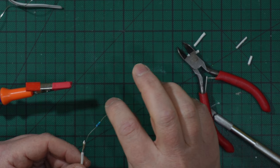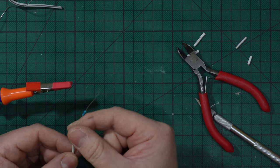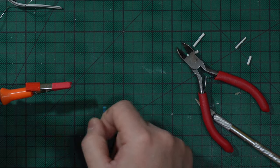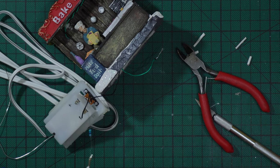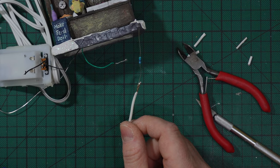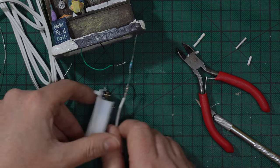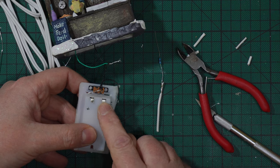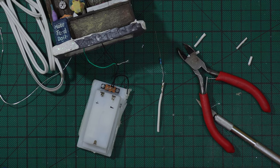This is the case of the single resistor you have seen. Here you add the positive or the negative, I don't remember correctly right now, but simply desolder the resistor from one of the poles there, and then solder the wire from the AC adapter to the resistor. In the other cases, you don't need to desolder a wire connected to a resistor if the resistor is not in one of those two points, but in another point. That's enough, guys. See you for the outro.